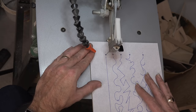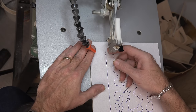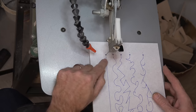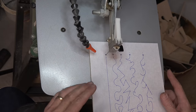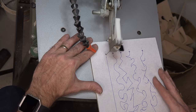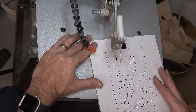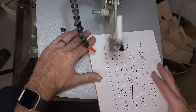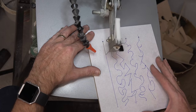We're going to start cutting this straight line. The saw is at 50% power, I have a number three reverse tooth blade, I've checked the tension for a nice tone on the blade, and I have the dust blower set to blow at the base of the blade so the dust stays away from my line — almost a little in front of it so we can see. Remember there's blade drift, so you may have to turn your piece almost sideways sometimes to get the blade to cut a straight line. You'll notice I'm not going fast — I'm taking my time and doing a good job with it.